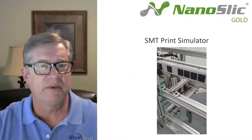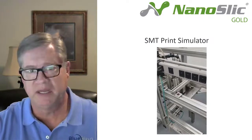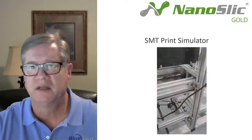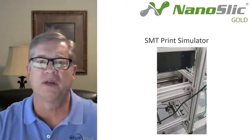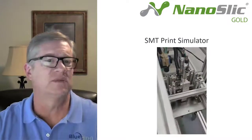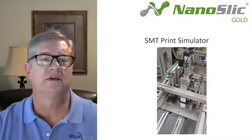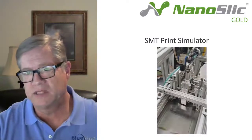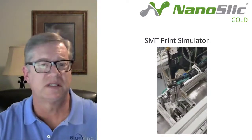We were then able to examine the coating and processes while they were tested for chipping and peeling and truly understand when changes produced real benefits. This print testing provided a data-driven method to test high-volume printing with real squeegee blades and a real PCB. Although this data was critical in the development of a long-life stencil nano coating, we wanted to understand even more, to quantitatively understand the adhesion characteristics of ceramic coatings to the very thin foils used in surface mount stencils.